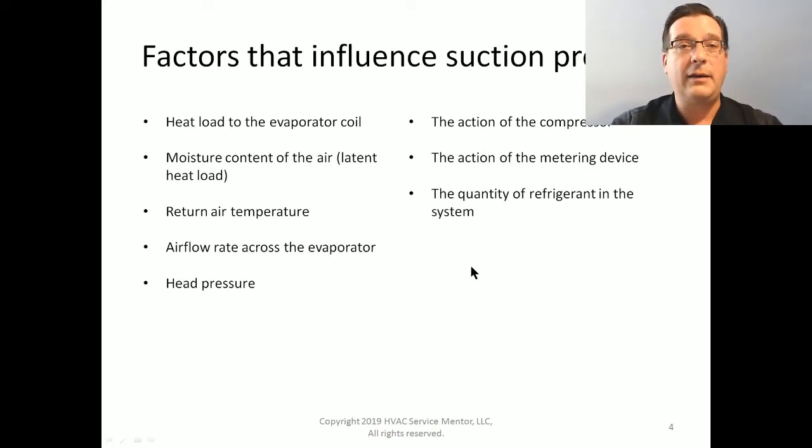And I put the answer at the evaporator. The reason why I say the evaporator is the most important is because that is the one that is responsible for doing all the cooling, for absorbing the heat. That is the most important part. That is where the magic happens. The other three components are just there to support that goal that the evaporator has, right? And here's the amazing thing. If there's not enough refrigerant in the evaporator coil, can it absorb enough heat? Well, of course not. The evaporator is not able to do its very important job.